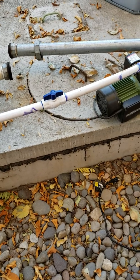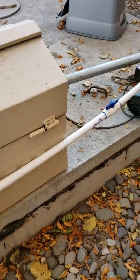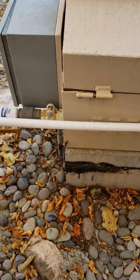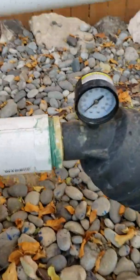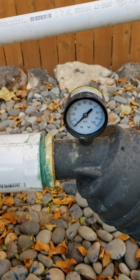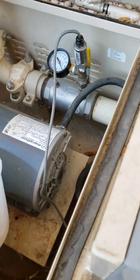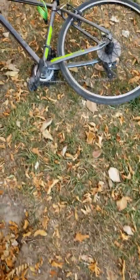In the next video I'll talk about the issues and why I think we were having so many problems with the original pump and what we did to fix it. The system typically runs around 55 PSI. I bought these pressure gauges at Home Depot — they're $10 each, but they're fragile; if you drop one it'll break. Really I just needed one at the inlet and one at the outlet to know the discharge pressure. But anyway, the Harbor Freight pump comes with a pressure gauge built in.